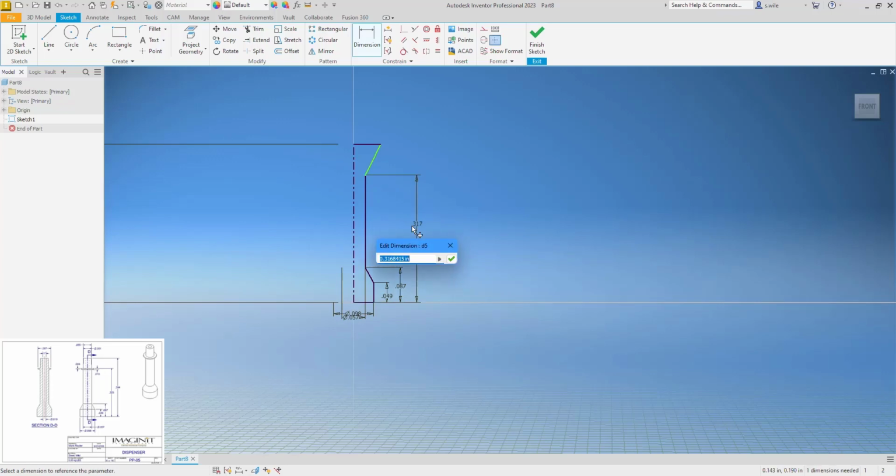So I think the taper on this is starting at the bottom of that extra feature. So I'm actually going to do, for this, I'm going to start my taper at 0.325 minus 0.01. And then I'll base that little flange that's right here at this location.